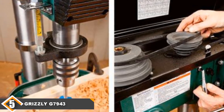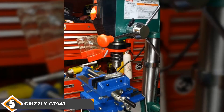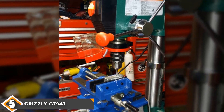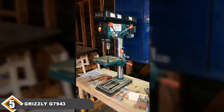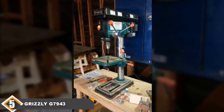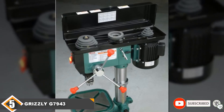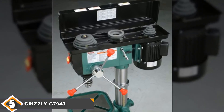However, this model has a big problem with runout — while operating, the chuck likes to wiggle and lowers your precision significantly. You may not notice the difference while working with wood, but it will be hard to get clean cuts if you're planning to do anything with metal, which is something you should expect out of a benchtop drill press at this price. It also includes a light mount but you have to provide the bulb yourself, which isn't great value. Ultimately, this is a very expensive model and you don't get a lot of value for that price, especially compared to the other models on this list.